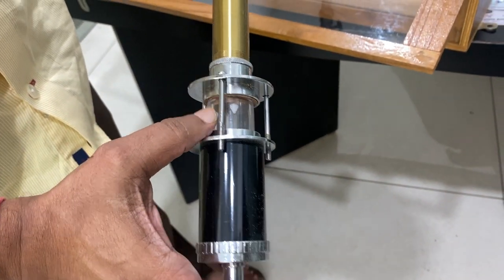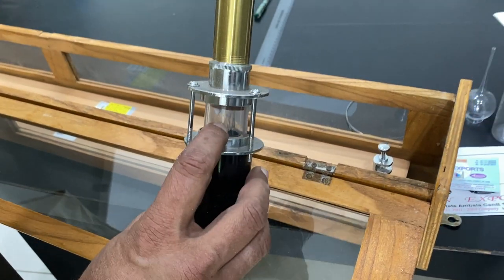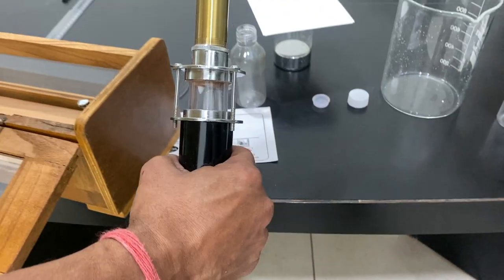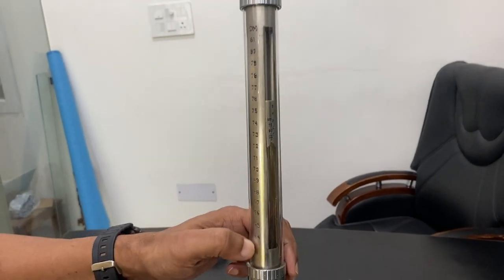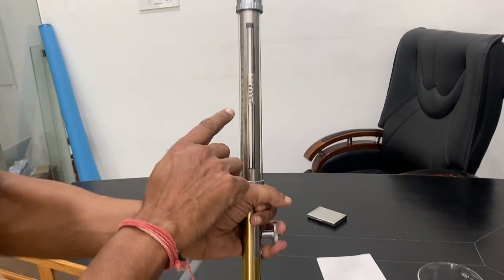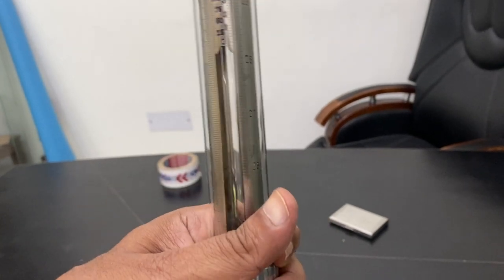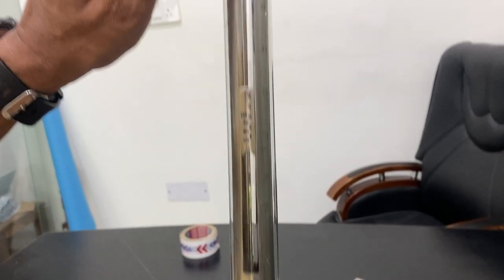This is the container — the mercury part which is here. There is a white pointer here. I can show you on the black side — there is one pointer here. This pointer is for adjusting mercury — it has to be adjusted with this screw. There is one chamber here — this is the top side, this is the bottom side. This has a graduation: 81 to 64, and this moves with the graduation. The vernier is there — it has 100 parts, 50 on this side up to 100 lines. One millimeter is divided into 100 parts. When you have to test the mercury, this bottom is to be touched to the center. There is a glass tube inside — now I will show you how to open the glass tube.